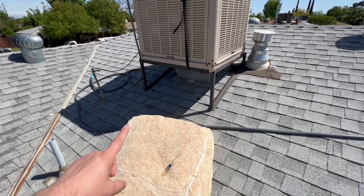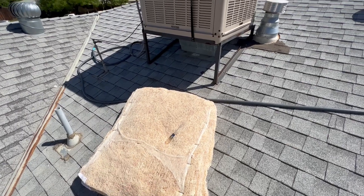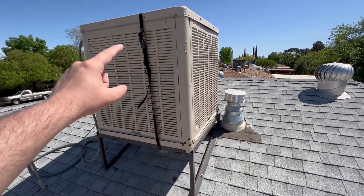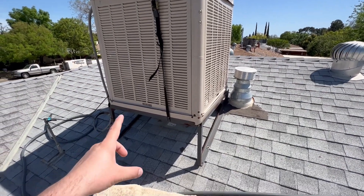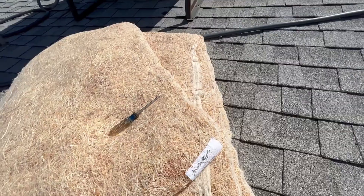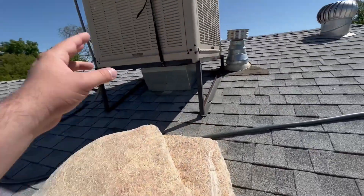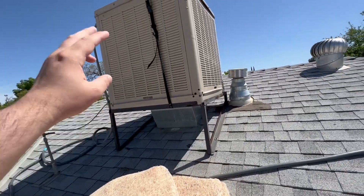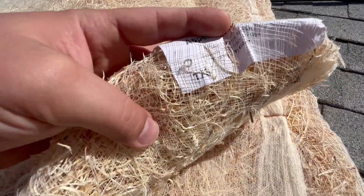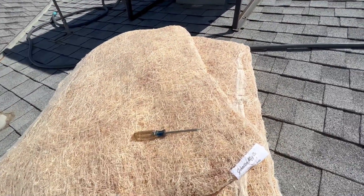Every summer you want to replace your cooler pads. The cooler pads are sized based on the width and height of your panel. Go to the cooler store and they'll tell you what size you need. They give you a number — this one is a 173 — and that determines the width and height of your pad.